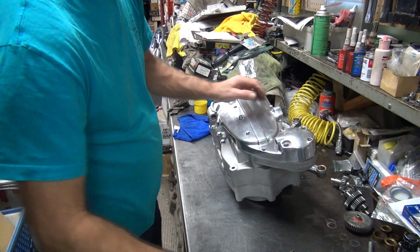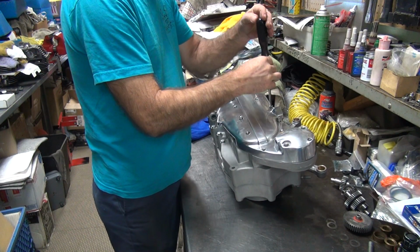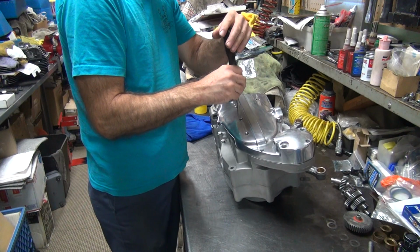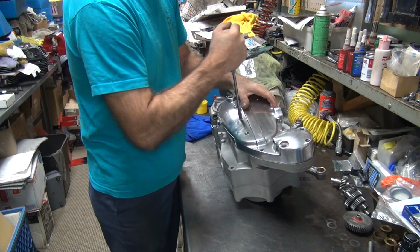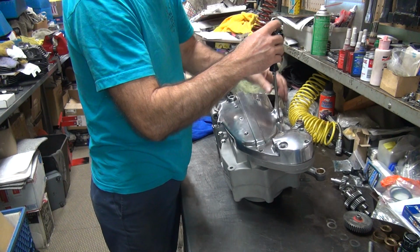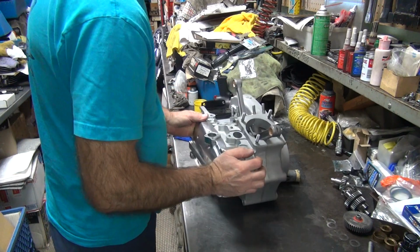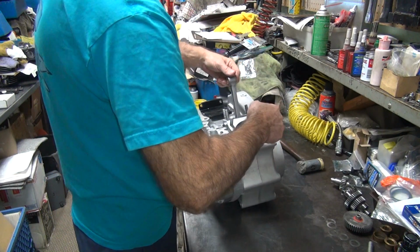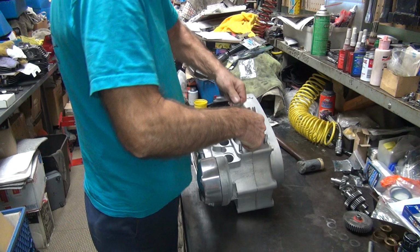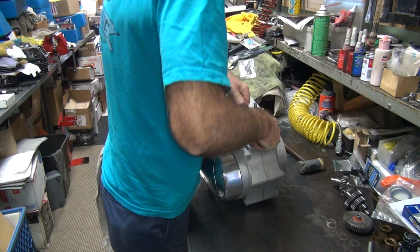Well, you put the cam in there because the cam does affect how things work together. But you're just gonna put that one cam? That's the only one that matters. Because it's the only one touching the pinion shaft, huh? Yep. The other gears won't make it a little tighter, though, just by friction? If you put them all in there, yeah. You only care about this. Increased it a little bit. Ooh. What is that sound? Tight cam, you mean?